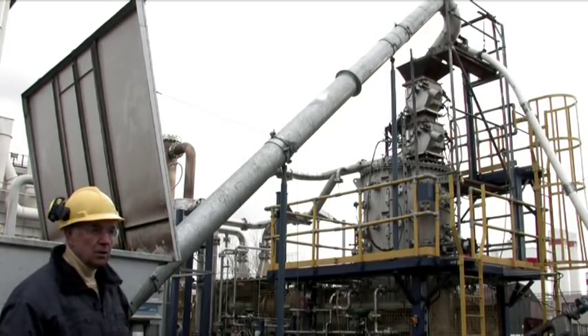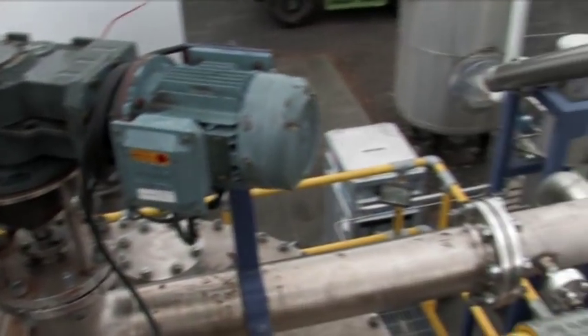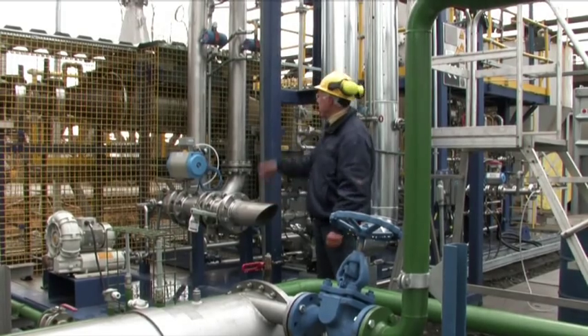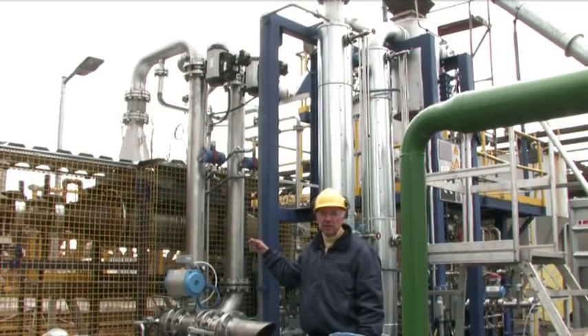Then the upper lock is closed and the lower lock is opened. This is how the wood enters the gasifier, where it is gasified at temperatures of 800 to 900 degrees Celsius. Due to the negative pressure, air is drawn into the reactor through this pipeline. Via this air inlet fitting, air is drawn in, passes through the heat exchanger, warms up, and simultaneously the gas coming from the reactor is cooled.